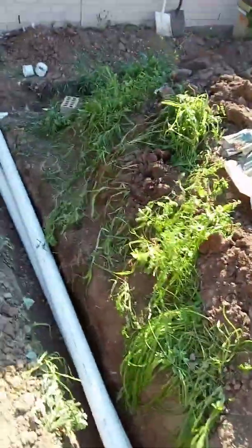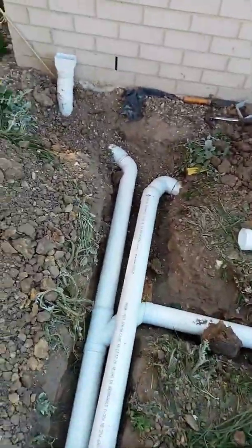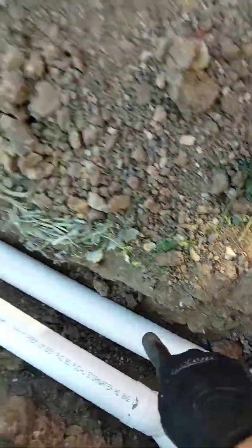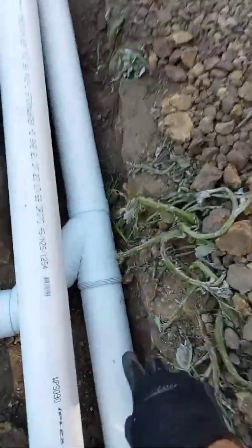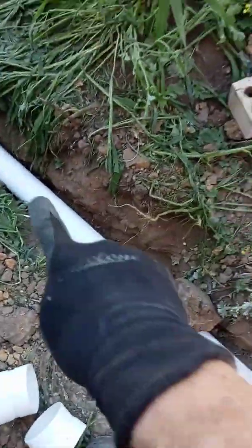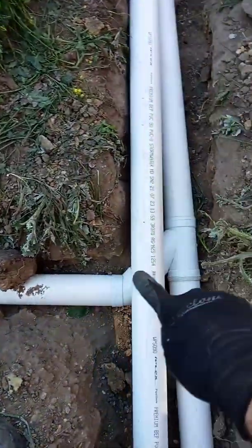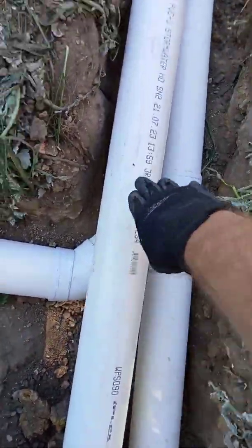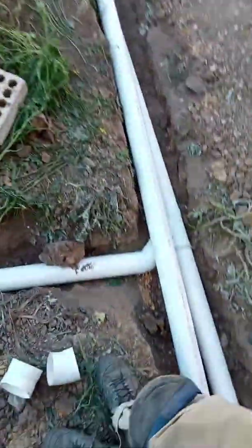That's pretty much ready to backfill here. We just need the pipe here — one of the downpipes going in — providing the water going into the tank. That pipe is underneath. This piece here is the water coming from the other downpipe joining in and going into the tank. And this pipe on top is the overflow, so this is going back into our stormwater system. That won't usually have any water in it, so that's why it's lighter and that one's on top.